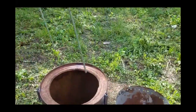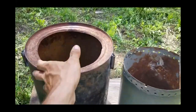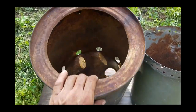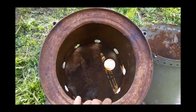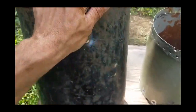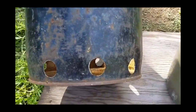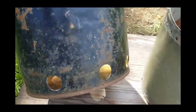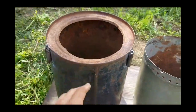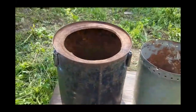Let's go ahead and pull that out of there. You can see I just used some piece of tubing as a guide for the rods on the grill. Inside here, there's just the hole for our inner burn chamber down at the bottom. I've used an inch-and-an-eighth hole saw, and those are four inches apart all the way around. That'll give us our airflow into the entire burn chamber there between the walls and up through the inner burn chamber.